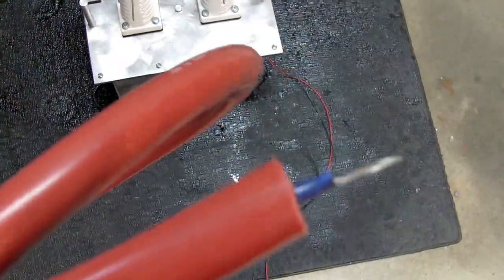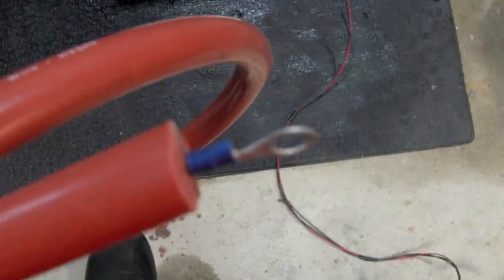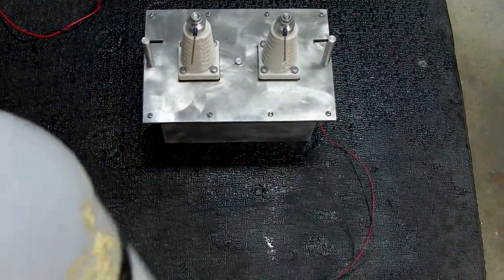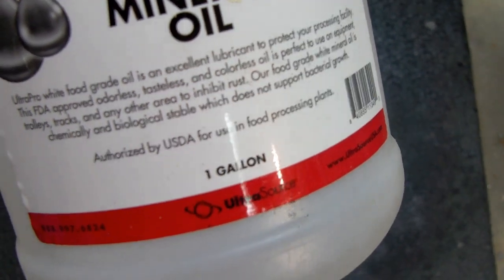This is the cable used internally to lead from the transformer to the insulators. It's 100 kV DC rated silicone wire. It'll take a lot more than that — I think it's proofed at 150 kV — but it seems to work pretty good for this application. It is oil safe; it's been in oil for a while and it hasn't deteriorated. If you're looking for a good insulating oil for a transformer like this, standard white mineral oil works best for the money. This is ultra pro white mineral oil — I think it was either $15 or $20 a gallon, about the cheapest I could find it, and it works fine.